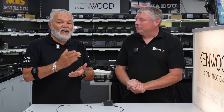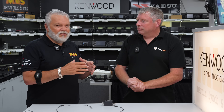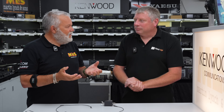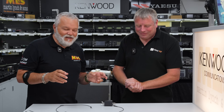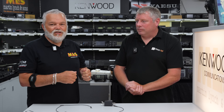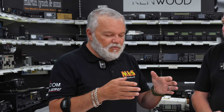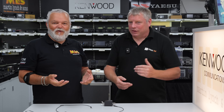That's exactly what I did at home without the preamp — so it's been a learning day for me with Matt. As you explained, because it's listening for the magnetic signals and rejecting all the electronic rubbish we don't want, if you use the preamplifier on your radio you're not just amplifying everything and then having to use your DNR or whatever to try and filter it out. Because this has got good selectivity on the wanted signal frequency, you can then use the preamp but you're only preamping the wanted signal — you're preamping less of the electrical noise and more of the magnetic signal that you need.